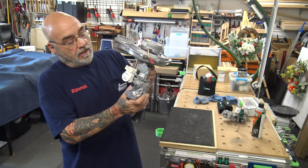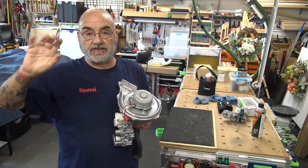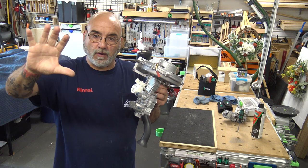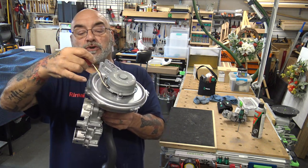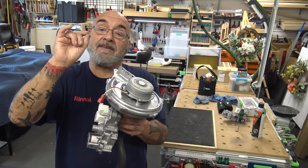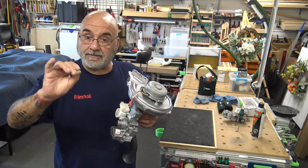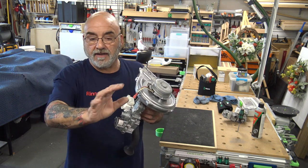All right, so what you're going to have here, there's 3 wires that are actually on the unit, but you're going to have to remove another series of wires. Now, if you go back to my video about changing a Venturi, I actually have a unit that is being pulled out. But again, I don't want to lose focus on what we're doing with cleaning this one. So you have this wire right here, which is a white, yellow, black, and red that is powering the fan. Then across that wire on the same clip, you're going to have a double white wire that goes to the temperature sensor in the actual vent. Then you're going to have a yellow wire, which is the flame sensor, and then the black igniter wire. You have to remove them because they're in the way. You're going to end up breaking it. Just remove it and let them hang down.